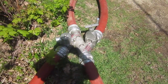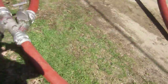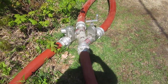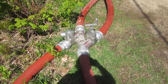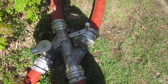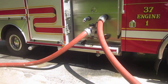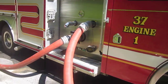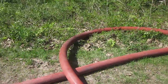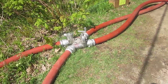What happened here is this hose got laid out with no pumper — they put a relay valve in. When the pumper shows up, you can see he hooks up to this gate, it goes around to his intake, and he then runs the discharge back around into the other side.